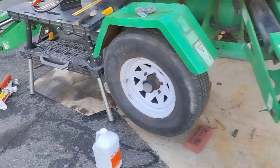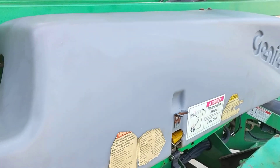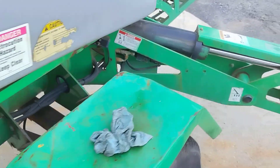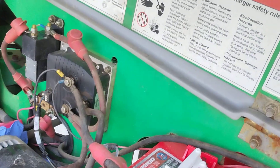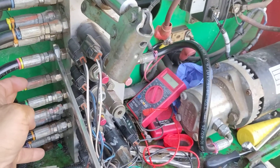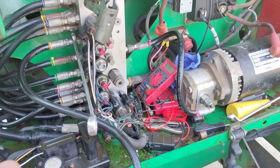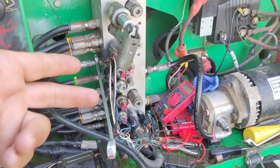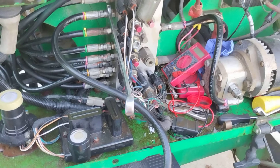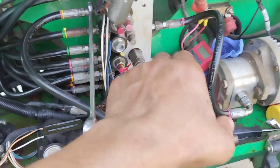But here's the crazy part — so that I can use this hand pump to make this thing do what I want it to do. Hand pump, it goes up. I don't know why it's bypassing when you use a hand pump. My theory is that when you use the controls, it tells it that it must open up the other solenoid — for a safety feature, it's got to open up the return. So you tell this thing to activate, the opposite side must activate also to open up, so it's opening the solenoids to allow it to open up. It becomes a one-way valve — a pilot check valve, that's what they're called. So when the fluid comes out, the one below it has to open to allow fluid to go back to tank, and then back to tank down there — not through the pump.